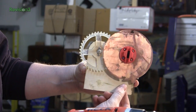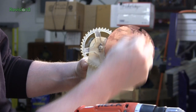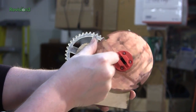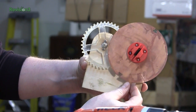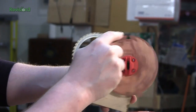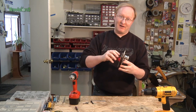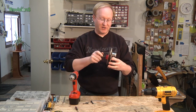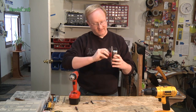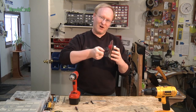The tab down here is going to go into an opto detector and signal the start of the frame. When the tab passes, the microcontroller will start the frame, draw the dots, then null frame, start of the frame, draw the dots — so it can time how fast it's going. The microcontroller can actually speed up or slow down the motor depending on the frequency it's detecting. That is assuming this all works.